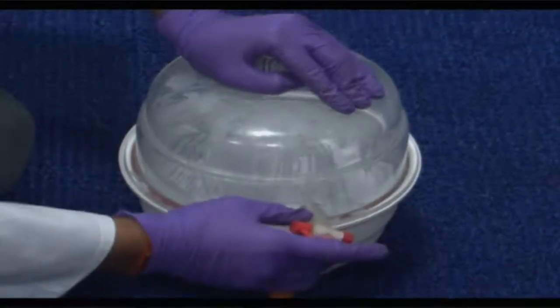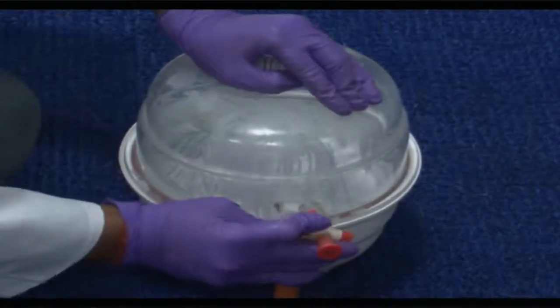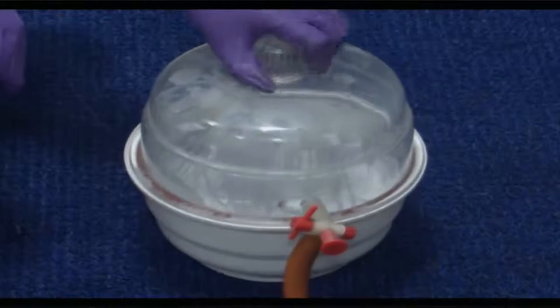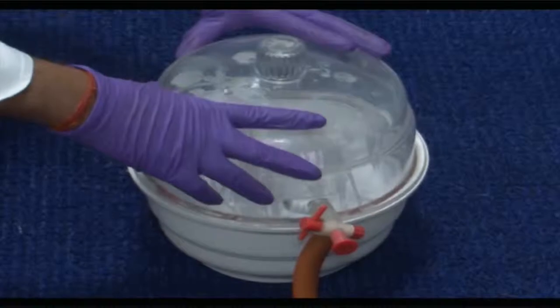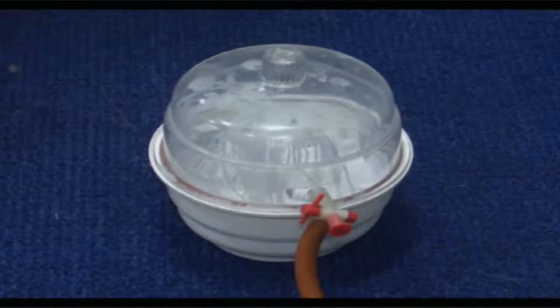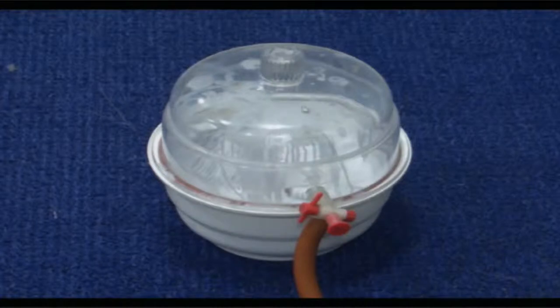So you can switch on the vacuum from the pump, which will make the desiccator stable. Now this has become under vacuum, as you can see, and whatever vapors are being generated by the HMDS are going to fill this whole chamber up here, and they are going to sit on that PDMS mold that we had created, the ridge like film that we had created, and they are going to make the glassy surface of the PDMS ridge hydrophobic, okay, so that you can use this for subsequently another molding step following this.